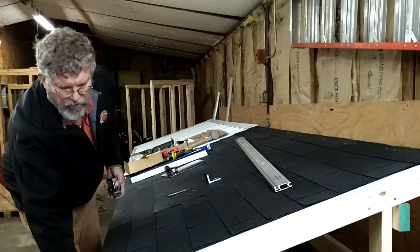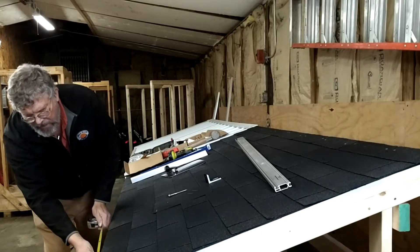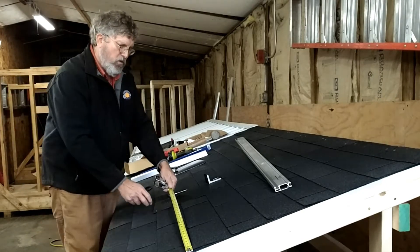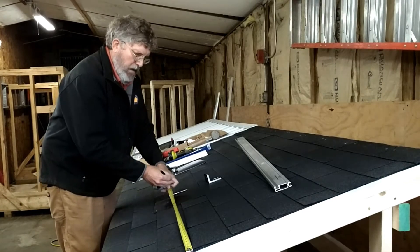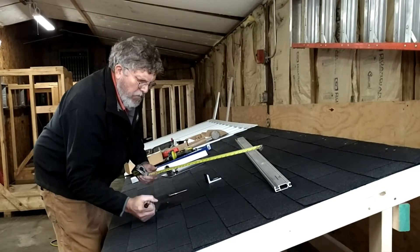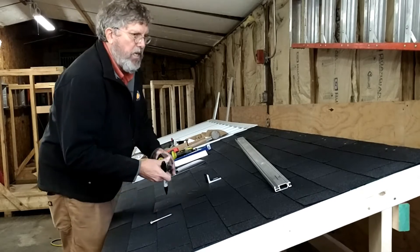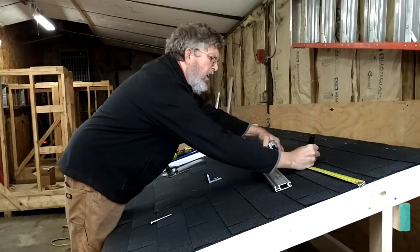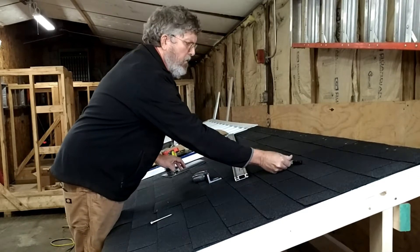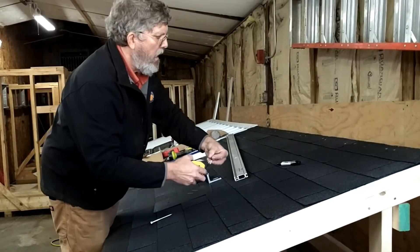We know that this rafter is located here at the end. Coming in, you'll do this perhaps underneath in the attic to find where that's going to be. Here I can find that it's 21 inches, so I'm going to find 21 inches on the roof and mark it — in this case, just a Sharpie. I'm going to indicate where that is, come in up here at 21 inches, make the same mark, and then with the chalk line you would go up on the roof and make your marks.